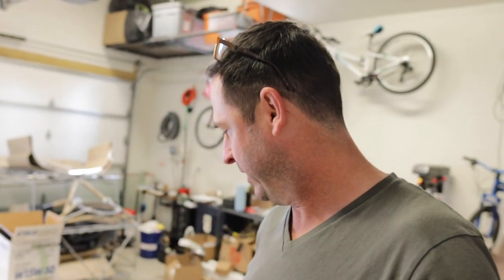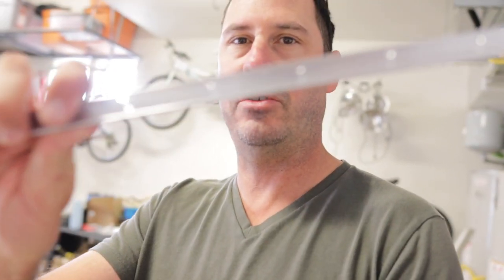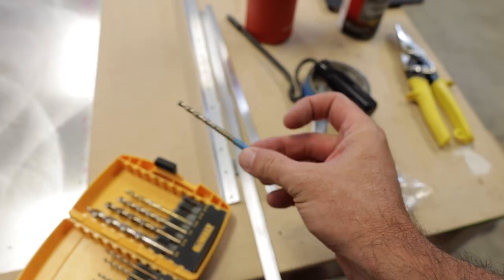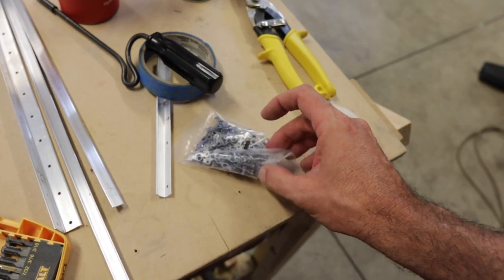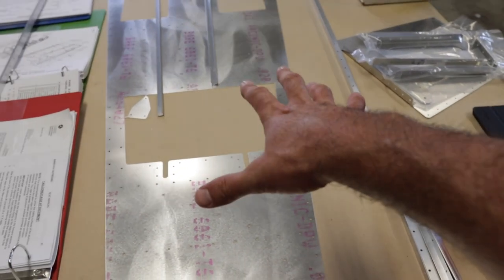What I need to do now is just prep all these holes, and there's about a bazillion and one holes to prep. On the inside edge of these stringers, it's a little tight for a typical deburr tool. So what I started doing is I took a slightly oversized drill bit. Also, the magnets are to verify if these were steel or not. These are some nut plates that go on these inspection tabs that are outside getting primed, because those nut plates are steel.